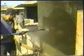It's also possible to plaster over formwork smooth wall without bush hammering by applying a high-pressure washing with the objective of cleaning the wall and removing the excess of demolding chemicals, followed by a thin layer with admixtures, on top of which you can proceed to plaster.